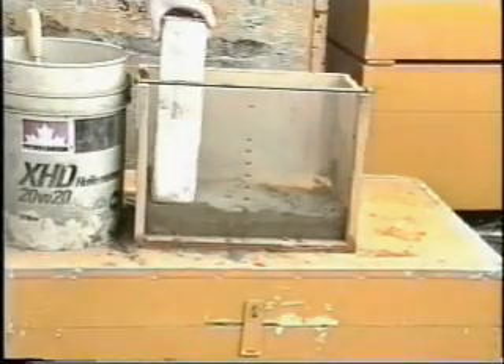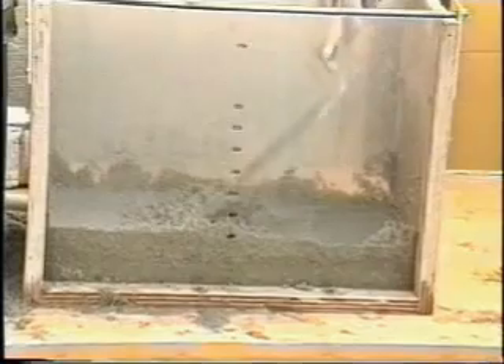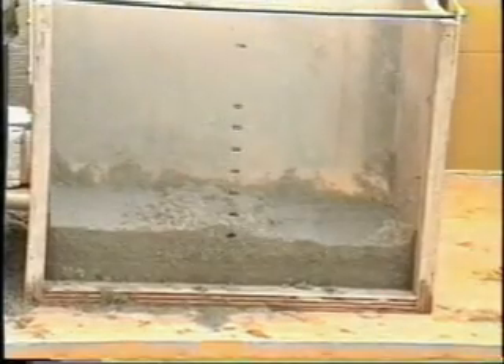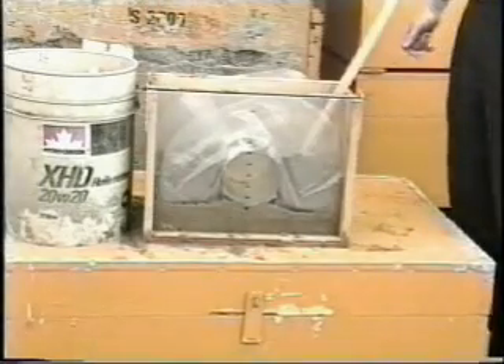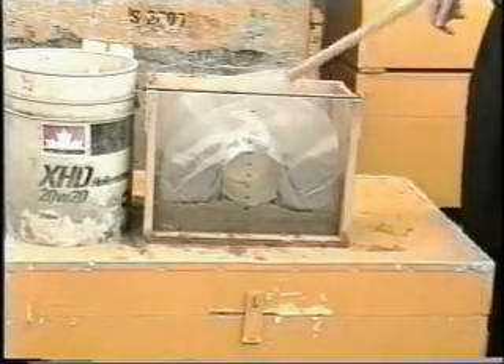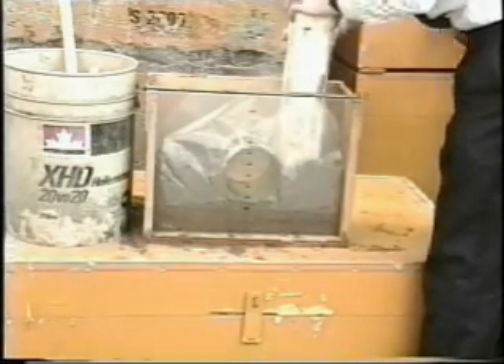In the final test, to simulate a properly constructed culvert foundation, the sand is placed in thin layers and each layer is thoroughly compacted. Loose bedding sand is pre-shaped to match the invert of the can, to ensure uniform contact between the bed and the corrugations of the bottom plates. Backfill is placed in an area called the haunches. The haunch area is subjected to high stresses, so extra care must be taken when placing and compacting this backfill. The remainder of the sand is placed in thin layers and compacted until the final elevation is reached.